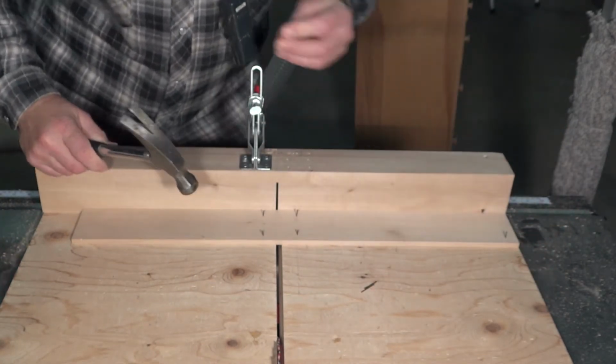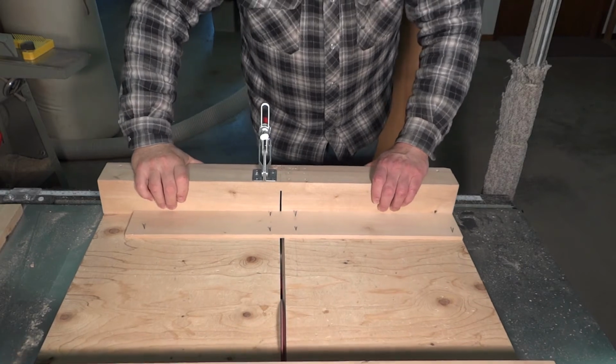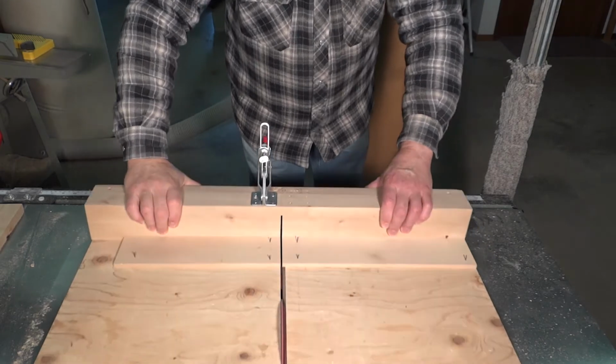Because the slot on my sled is so wide, I'm nailing down a board which I can set the pieces on to cut for my thin dividers. I just run the blade across the board and have a zero clearance bed wide enough for the stock I'm using.